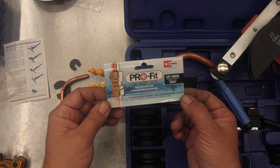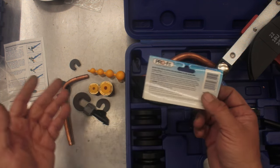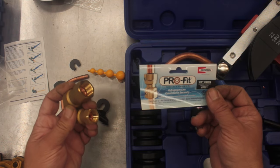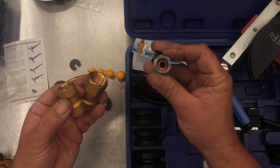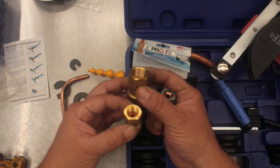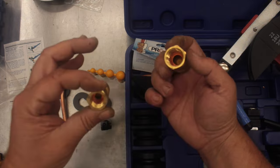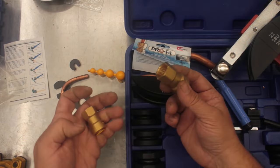They're suited for air conditioning, rated for high PSI — the specs are on the website. It's as simple as: cut the pipe, deburr it, use the prep tool to mark depth, slide it into the desired depth, push the fitting in, and double-check through the window. I'd rate these products a 10 out of 10 because they're solving a job that would otherwise be ten times harder. Even the torque setting to tighten the nut is simpler — cut it, dress it, stick it in, torque it down, and you're good to go.